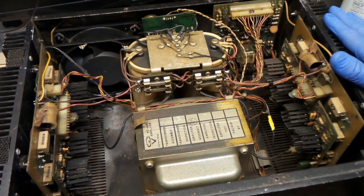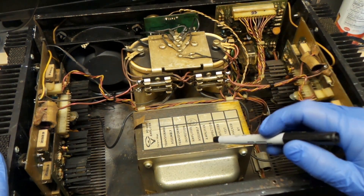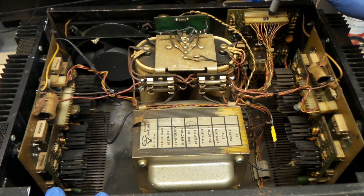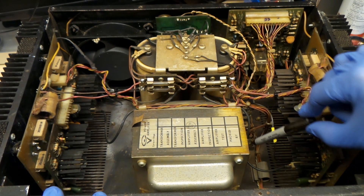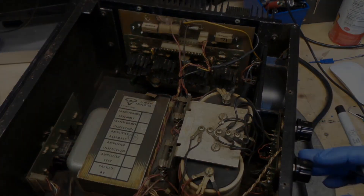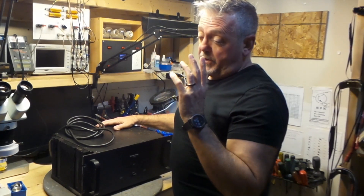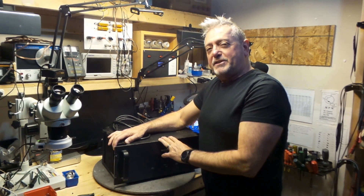Now that the bias has been set, let me show you what was done. There's a big transformer that weighs about 10 pounds. The large filter capacitors were tested and work well. I had an issue with the protective board and had to change three capacitors and one resistor. I cleaned the relay. Down there you'll see my rectifier where everything is changed from AC to DC. I cleaned all of these, and the output transistors have been taken out and repasted. Okay guys, the Cerwin Vega is ready to go back to its owner. This was a fun project. If you like my video, thumbs up, leave me some comments, and subscribe to my channel. Thank you.